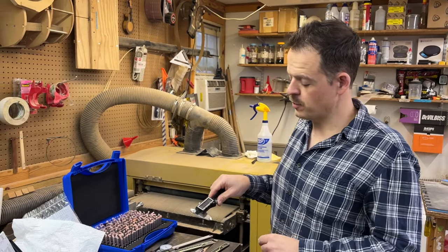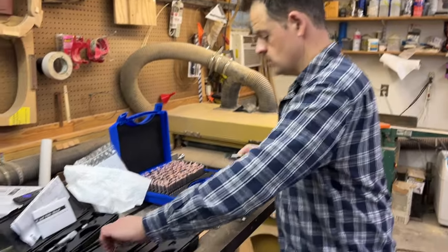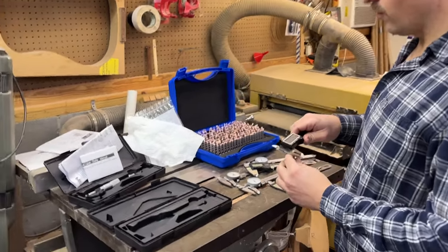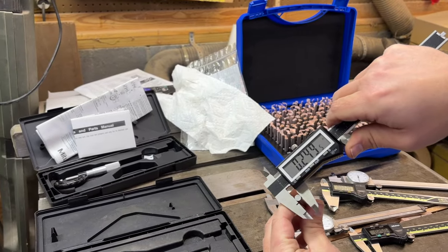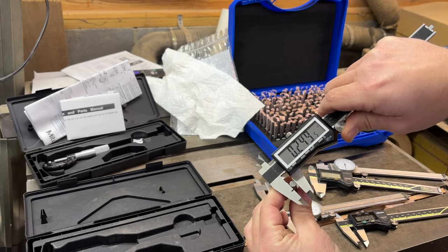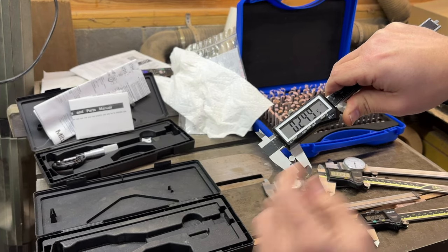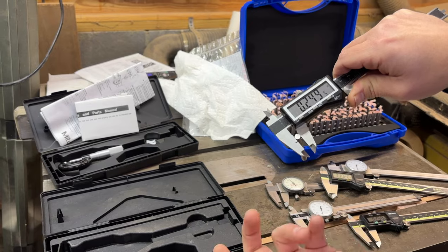I also like that the display is pretty big and easy to see. And as you can see, like he was talking about earlier on these pin gauges, they read them reasonably. When we checked it with the micrometer, it was a light 250 - probably 249.8 like dad said. This one is recognizing that it's light, but it's only going to be able to say 250 or 249 and a half. Can't do nothing in between.